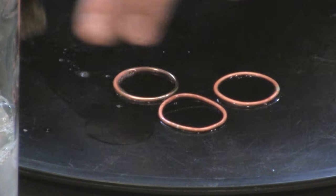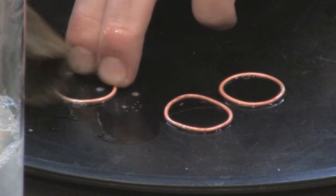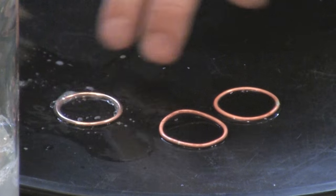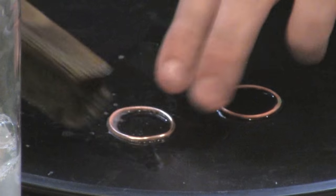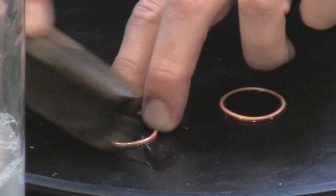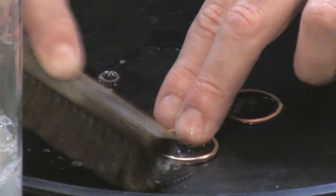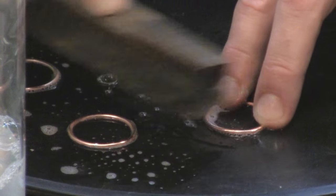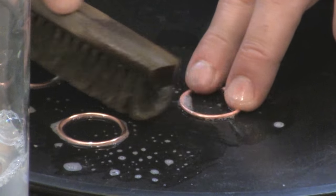And now they look copper again. If you look carefully, you can see that the solder is really minimized to just the seam. Now if I want to improve upon that, all I have to do is take a file — perhaps a half round needle file — and maybe some 400 grit sandpaper, and I can knock off any excess solder off of the surface and improve the appearance of my piece. And of course, if you're making it out of copper, you could plate it with copper, which would be done with spent pickle — there's a video on that. You could also take it to a commercial plater, and we have a video on that as well.